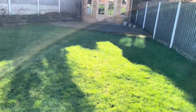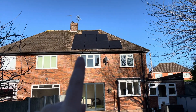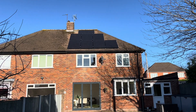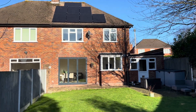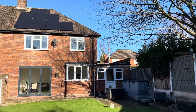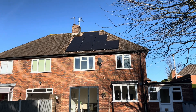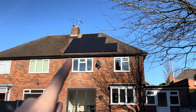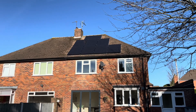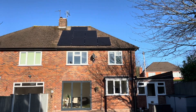We're out in the garden now. I'm going to walk down to the bottom of the garden and then turn around and show you the panels. As you can see, these are the panels on the back of my house — these are eight 440-watt panels, and I've got another five on the side of the roof. I can't show you those at the moment, but as you can see they are generating really well — I'm currently getting about 3.6 kilowatts from all the panels. The south-facing panels are probably doing the majority of the work right now. It's about one o'clock in the afternoon.